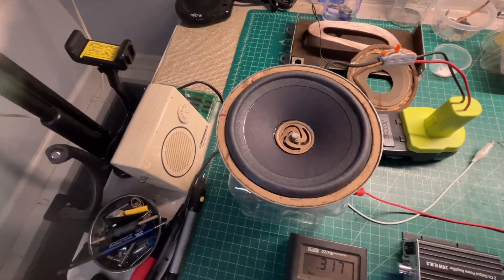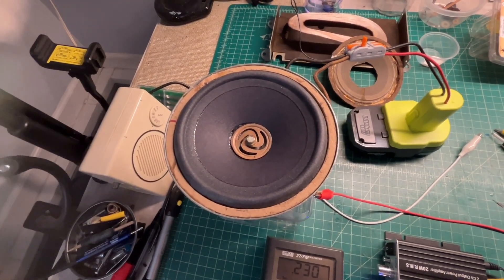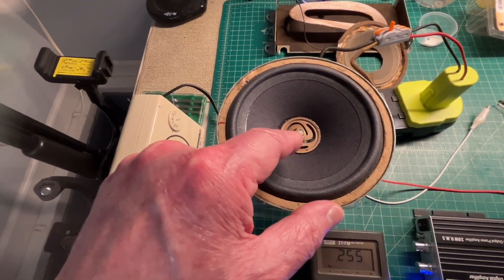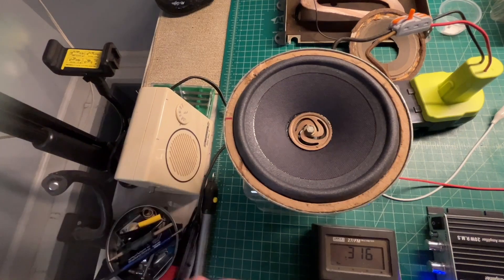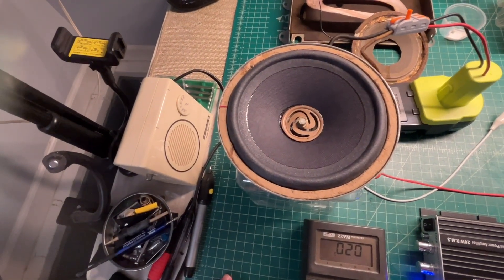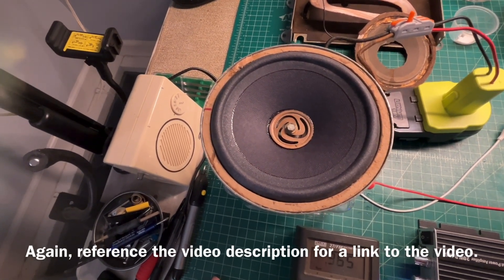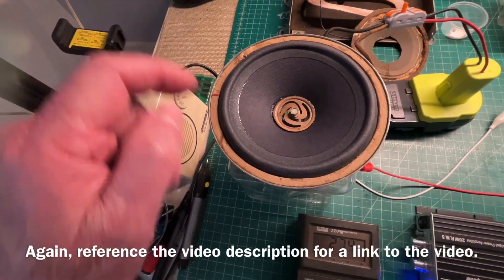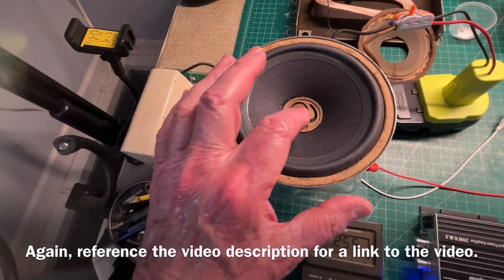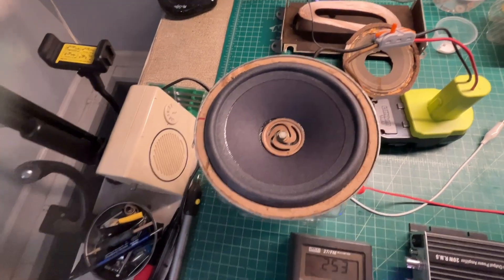Just finished reconning the loudspeaker for the Philco 37-600. Seems to be performing well. I took a different approach on making sure that I had the voice coil and spider centered — this is the internal spider. I'll put a link to the video I used for reference, just using a 50 hertz tone. I had the glue loose around the surround and then tightened down the spider to the center pole piece, but she sounds pretty good.